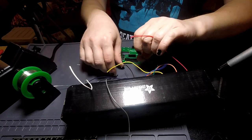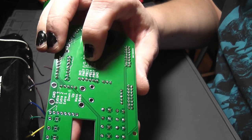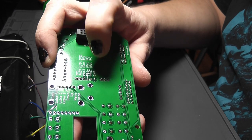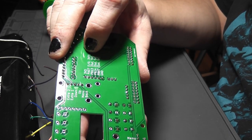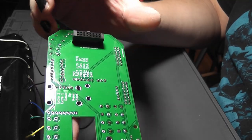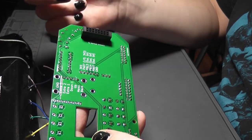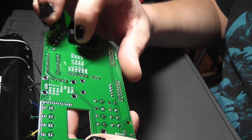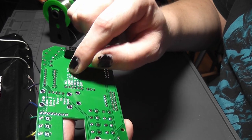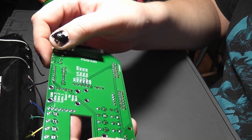All right, so to do this, I'm going to use the pins here, the extra pins. These are the pins that are not used for anything, but I have power, ground, and the last IO pin available here. When I rework the board, I'm probably going to make a selection between this pin and a pin header and just provide a pin header to be able to use the connector on the side of the matrix portal. But for now, I am just going to bodge wire to this input pin because this is an analog capable pin, and to this ground and to this power, just to make the bodge wire shorter.